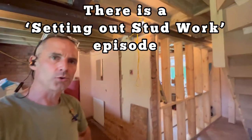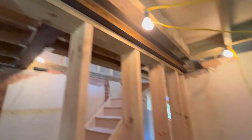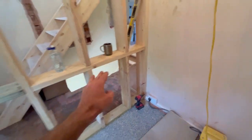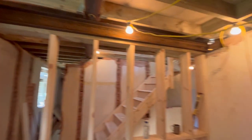That footage is there if you want to watch stud work, setting out, lasers and levels — head off to the channel and have a look. But that's all done now. We used the last of our 72, which is c24 stuff, so we didn't want to waste it. Since it's internal, I've just used the last of what we had, pulled a piece across there, and done it that way. That's just a continuous noggin there which isn't going to affect any structure at all, because when I put the timbers on top I'll fix straight through top and bottom — more than strong enough.